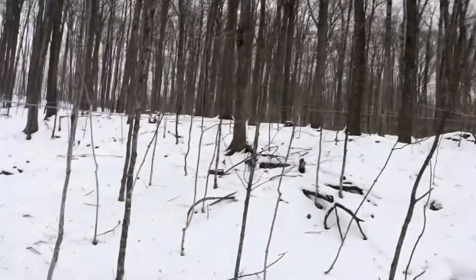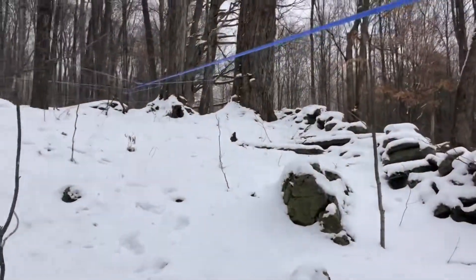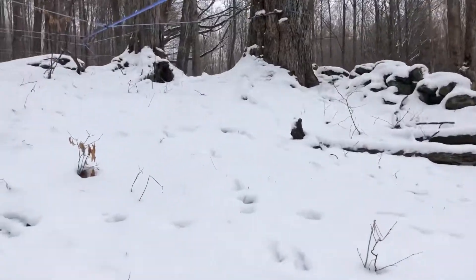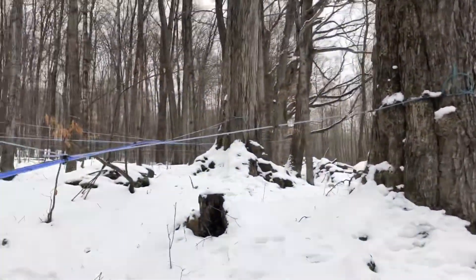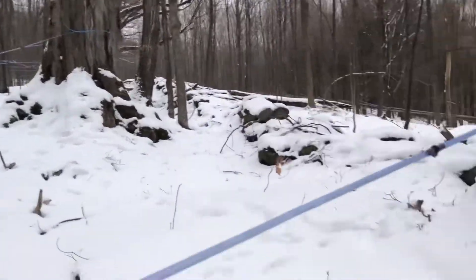Trying to make 29 inches of vacuum right now, just trying to get it tight. I'm just trying to get to like 25 or 26 inches happily with my VFD — meaning the pump's not running at full speed. 60 hertz trying to curate that 25 or 26 inches of vacuum.